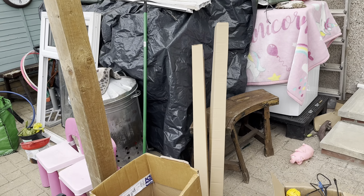Right, so that's the armoured made off. We've still got to strip the internal cores and then identify them with some tape. I'm going to tuck the banjo on, coming up through this 20mm knockout, and stick the banjo in - screw it in the middle there just in case that one wants to be used at some point. It should be in a good area to still put one in if they want a central heating link. Going to get that in now, then second fix this, and then once this is in we can get the cover on the board and that's one job done.